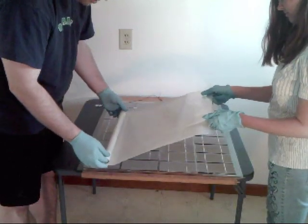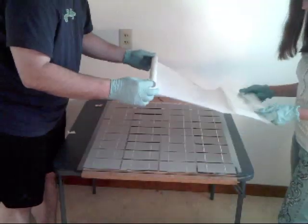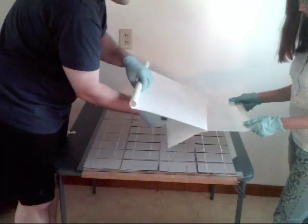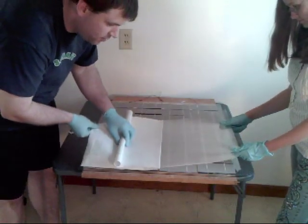Go ahead and remove half your spacers and start spreading out your laminate. You can use the bottom edge of the glass as a guide to keep it nice and straight. Now you'll see that we screwed up here a little bit — this bottom sheet is about an inch shorter than I wanted it. It's supposed to be 28 inches long; it's 27.